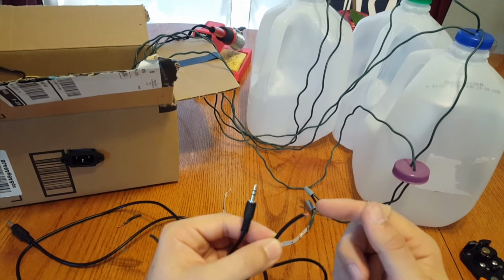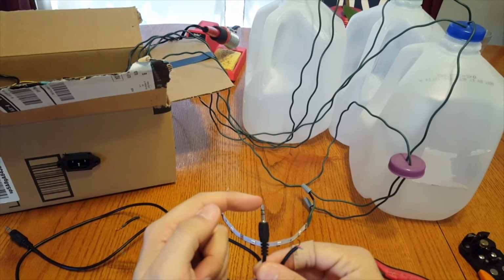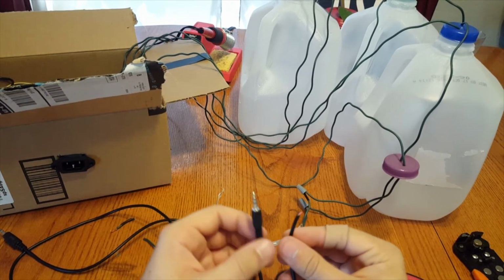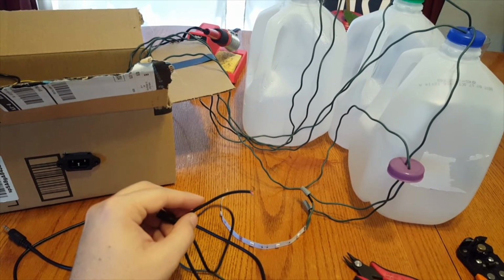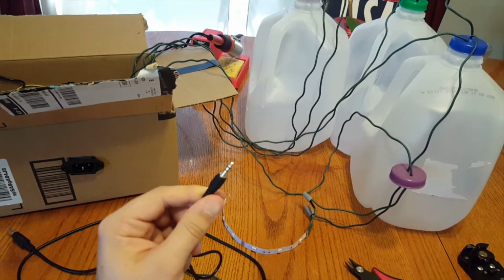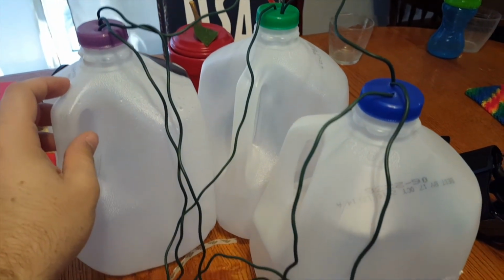And you can also test that just by doing the continuity test, where left is the top one, right is the middle one, and ground is the bottom one. And then those respectively will connect to the Adafruit soundboard as shown in the wiring diagram, to the left, right, and ground terminals respectively. And then you just have a regular headphone jack that just can go into any speaker as a sound output. So these are all the lights hooked together.